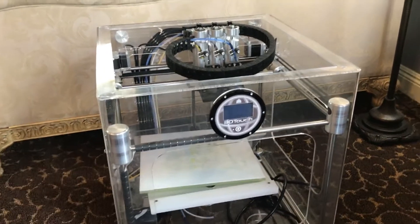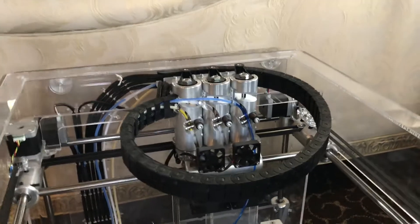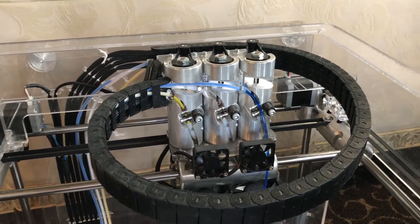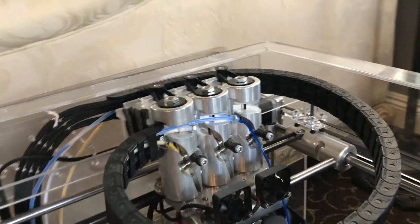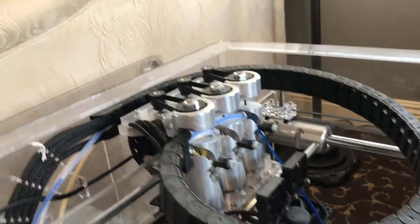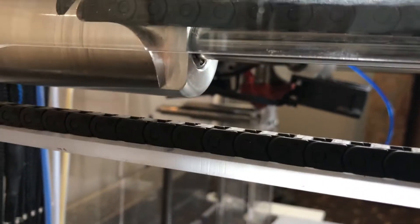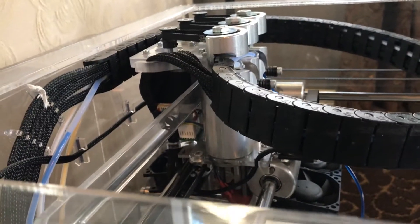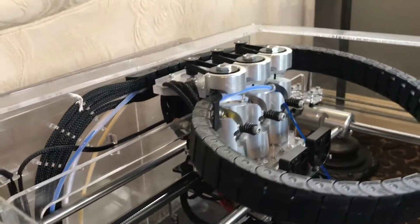It's really heavy, and when you look at it — just the extruder itself — it's no wonder. It's actually a shame because the aluminum components and the machining that went into them are like works of art, but they're just so bulky. You can see here with the three extruders: the stepper motors are back here, hot ends are way down here. Just this assembly alone weighed about eight pounds, so there's a lot of weight being flung around.